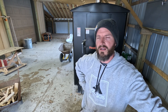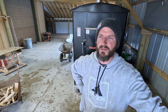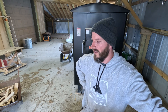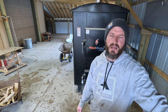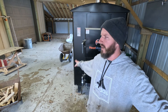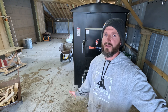I did change the settings again — I don't have it burning as hot. I got it back down to 170 to 180, had it at 185. Come later in the spring when I'm just heating the hot water, it doesn't need to be 180 degrees — I may lower it to 165 to 175, we'll see. If you're burning properly you don't even have to take out any ash up top — just stir up the coals and any fly ash will go down below and you clean it out from there. If you have to clean out the top, you're not doing it right — I was told that when I first got it and I haven't cleaned the top since probably November.